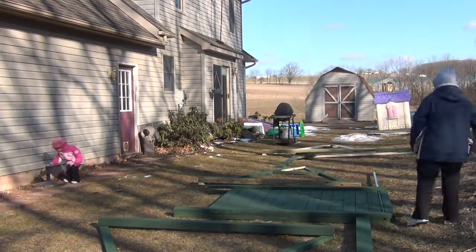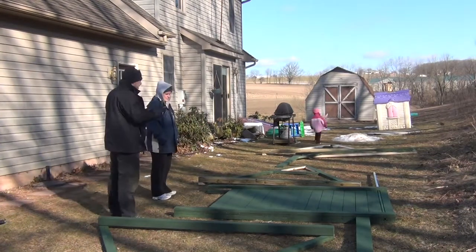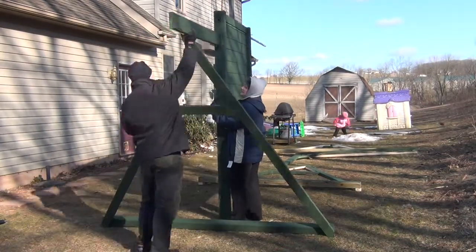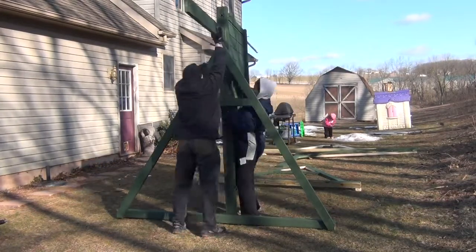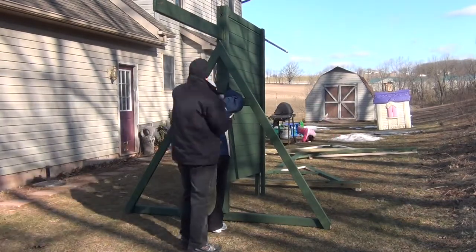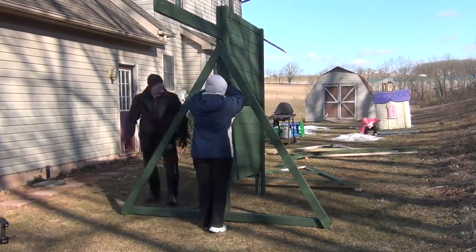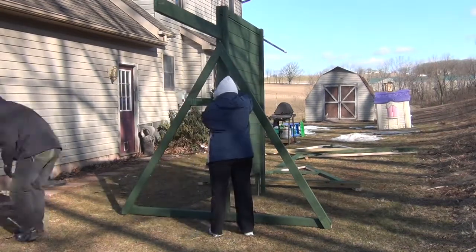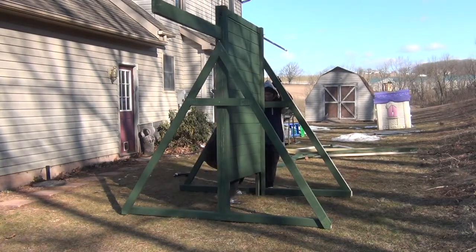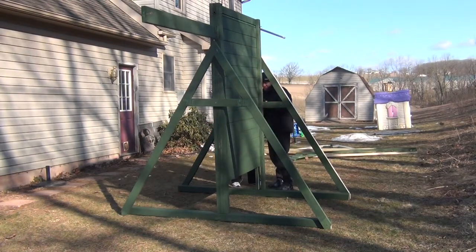All the pieces — you can see I painted with flat exterior paint just to fit in with my outdoor area. Then with a little bit of help, you put the trusses up. Put a couple of screws in there just to get it straight; you don't have to get it all screwed in really heavy yet. But once it's up you can come back and put in multiple screws per truss just to get everything set up and very strong. I went back through and drilled a couple of pilot holes with the cordless drill — the pilot holes keep the screws from splitting the wood.